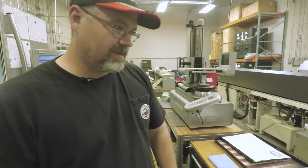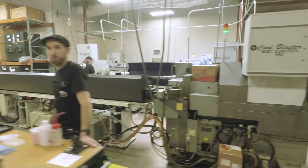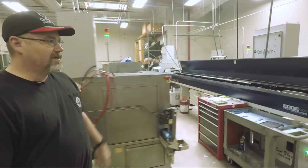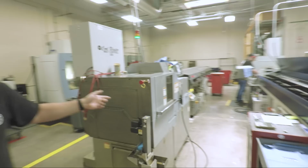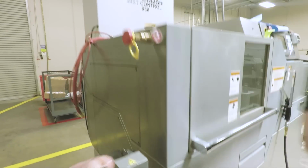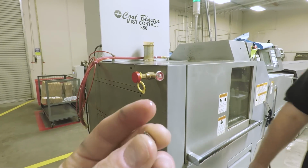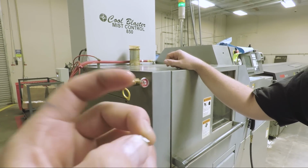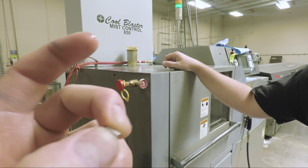Holy cow. We just walked past a whole bunch of Swiss lathes. We just added our fourth Swiss machine. You see all the little parts that go on that assembly in there. It just tends to lend itself to a Swiss machine. Totally. What are you making? This part. So the stem will go in here, the ball goes on the end of the stem. That's an M2 thread.